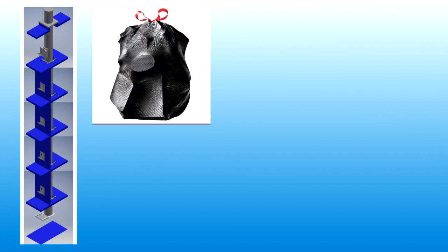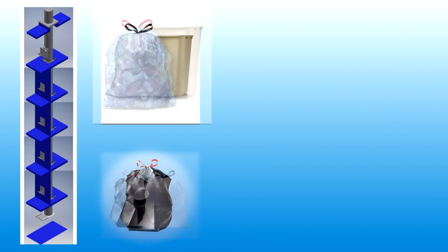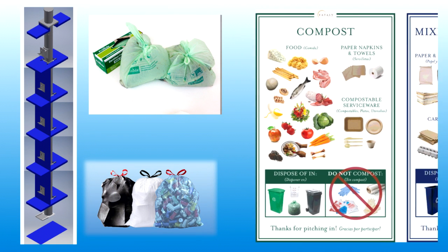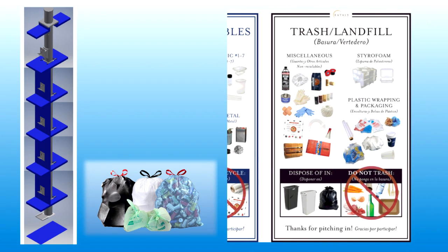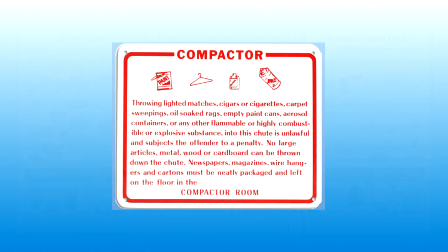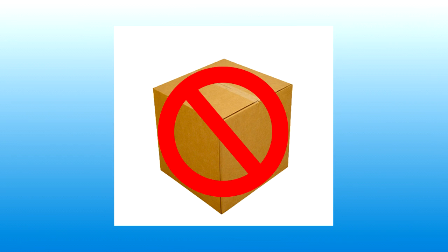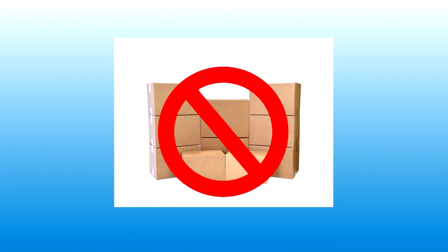With regard to waste disposal practices, the chute system essentially provides waste transportation. Rules and regulations about specific types of materials are determined by the waste management company responsible for removal of waste from your building. Ideally, waste disposal information will be posted near intake doors. In addition to waste management requirements, avoid oversized objects or light bulky material such as styrofoam packaging. These items may get lodged or jammed inside the chute, creating blockages that cause material to back up inside the chamber.